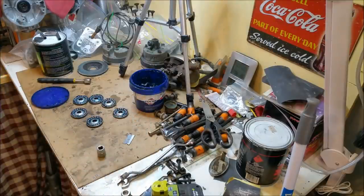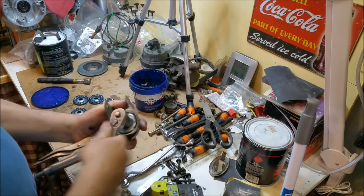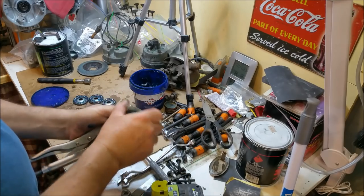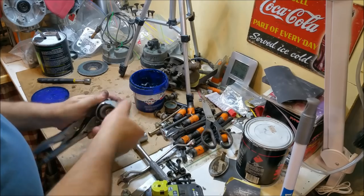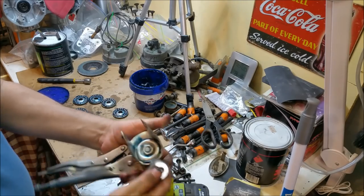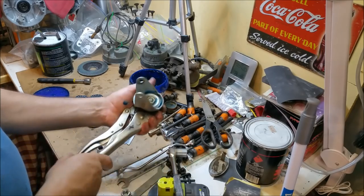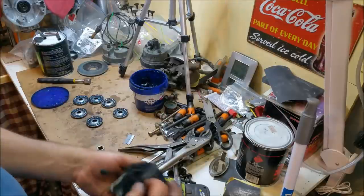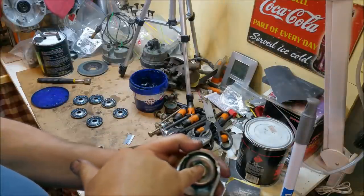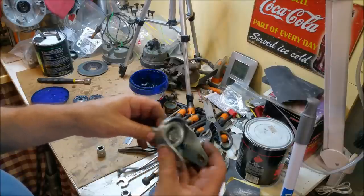And my spinner. There's a bit of resistance over where they initially punched it. That's probably a bit too tight. Oh, gosh. But what I can do, without really sticking any heat into it, I'll just loosen that a tiny bit, and that's beautiful. So what I'm going to do is I'm just going to drop a dot of weld just there, and that will lock it, because it was just causing... Well, it's still slack there, isn't it?